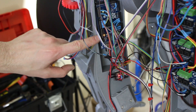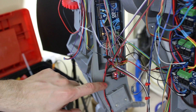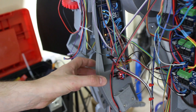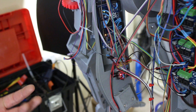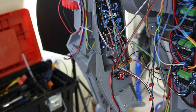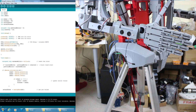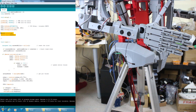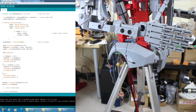First we're going to get the motor running again with feedback and a PID controller, and get the forearm rotation servo wired in. The short recap: we have an Arduino Mega on each side of the robot controlling most of the shoulder and other bits. The forearm mixing was controlled by another Arduino Pro Mini, which passes two variables it gets from the brain — one for the elbow and one for the forearm rotation. I'm just going to take those and attach them back to the elbow and forearm rotation. We don't have any data for the hand yet, so we'll come to that later.